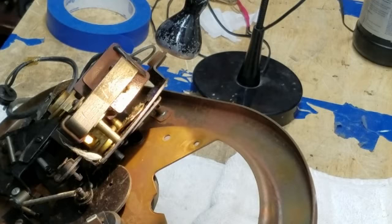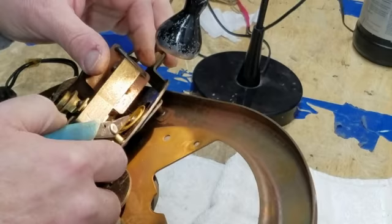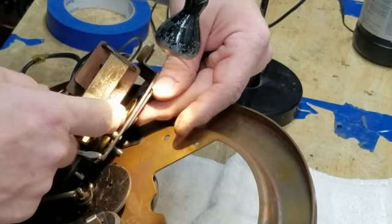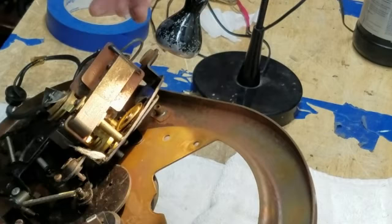Let's make sure that I don't have anything that's going to fall out on me. Clean up this brass disc a little bit. It looks like that disc — nope, it doesn't come off. But there is maybe a shim right there — nope, that's a clip. I'm going to leave that clip alone. This is a retainer disc, so whatever it is, it's clipped from this side — like the bushing for that wheel is retained by this brass disc. This will have to be cleaned and lubricated in here, and there's a little circlip in here that maintains that disc on the brass bushing that the idler wheel rides on. It's a fairly complicated arrangement.